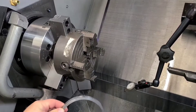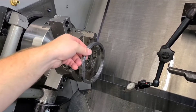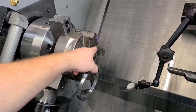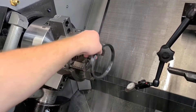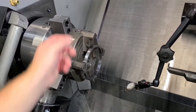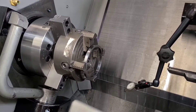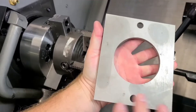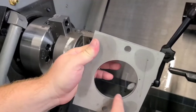Let's make sure everything is clean before placing the next part. I have a spacing ring here because I need room to actually machine my bevel — I'm dropping in with a grooving tool to do the work on the back side. We're going to place the spacing ring and grab our part. The part is rectangular: six and a half inches tall and five and a half inches wide, and we've got the convenience of a circle on the inside.